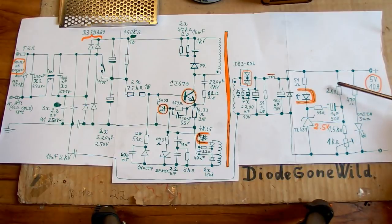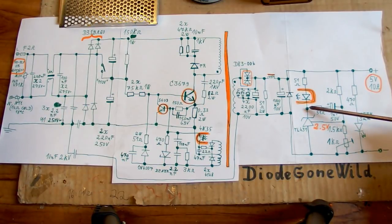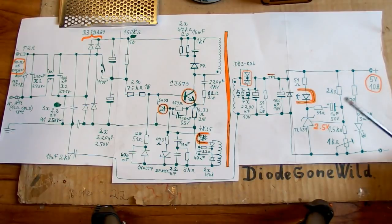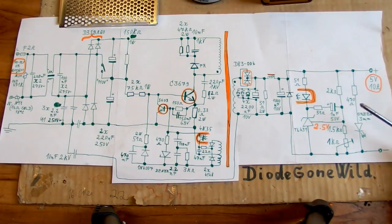And this voltage sensing circuitry also has some resistor and capacitor as a negative feedback for stability. It basically slows down the changes, so it doesn't overcompensate sudden changes at the output, especially when you suddenly increase or reduce the load. And also to prevent oscillation of the feedback, basically. It's the condition when the feedback overcompensates, undercompensates, overcompensates, undercompensates. It's necessary for the feedback not to react too fast. And here's an indication LED with a resistor, and here's the potentiometer to adjust the output voltage.